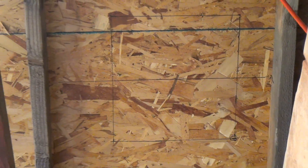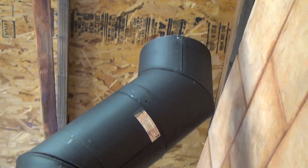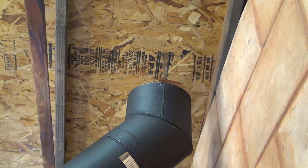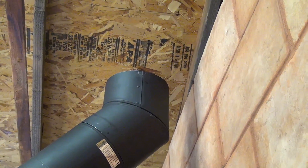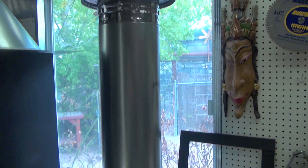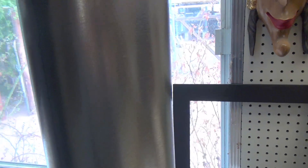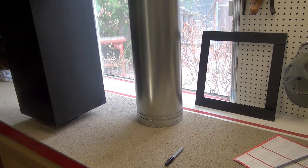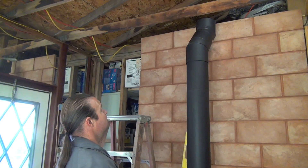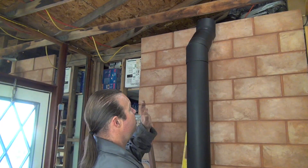I have the square layout marked up here for the hole. This meets all my clearances. I need one piece that goes above this elbow — it's an 18-inch telescoping double-wall piece by Metal Fab. The local stove shop has it in stock for $120 out the door, whereas online it would've been $50. I'm going to get the chimney installed before it rains in a couple days. Here's one of the pieces, the spark guard, and here's the chimney pipe itself — really good Class A chimney pipe. Everything on the roof is galvanized, so I went with a galvanized casing rather than stainless steel. I have about four or five hours before dark, so the goal is to get the chimney done.